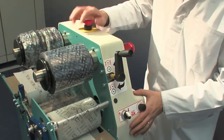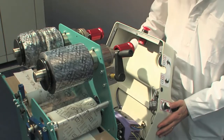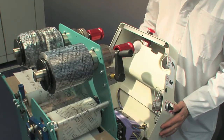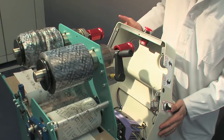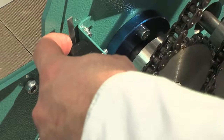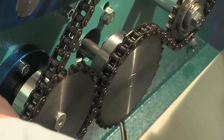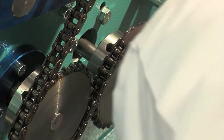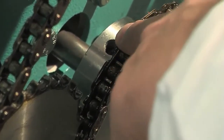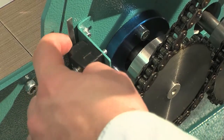Now the casing is only fastened to the machine through the two connectors — one on the engine and one on the safety microswitch. Move the casing so that you can work inside it. Be particularly careful at this stage: risk to cut or crush your fingers. 220 volts voltage. If necessary, let the machine move forward until the grab screw which fastens the engine gear to its shaft is in vertical position to facilitate the disassembly. Switch on the machine and manually close the blade safety microswitch.